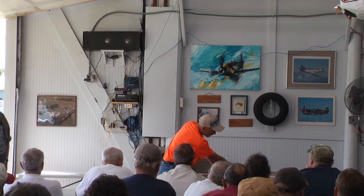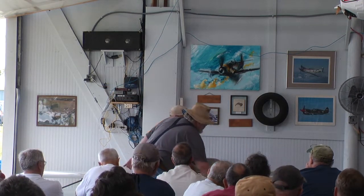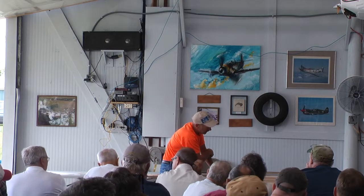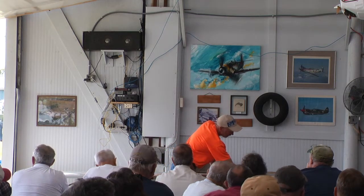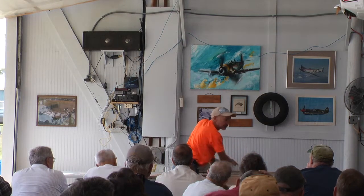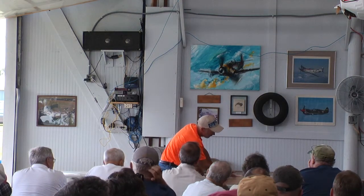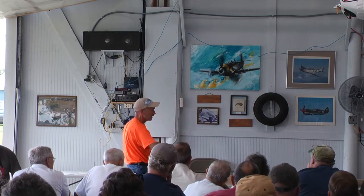After you cut this block out, you need to draw a center line on your block all the way around, right directly in the center, so that you have somewhat of a measuring from. When you get your 2.5-inch dimension that I just calculated, you measure from the center line up on the leading edge and from the center line down on the trailing edge to plot that point. So I had a point at each station at that time, and I just connected the dots with a pencil line all the way around the propeller.